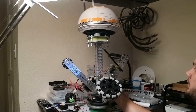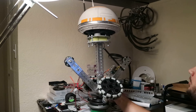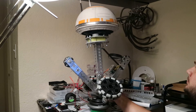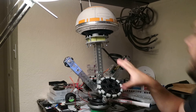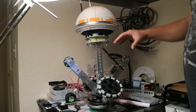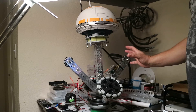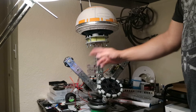You can see it more than easily moves the head. So when I'm driving forward, I can have his head lean forward. If I stop at somebody, I can have them look up. That gives me forward and tilt. And because I have a hamster drive, even though he can only move forward and back, if I move him forward and turn the head, I have the ability to rotate the whole body within the sphere. So I actually get 360 degrees of movement, even though I only have forward and back.